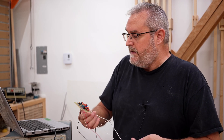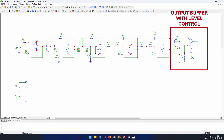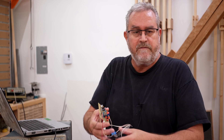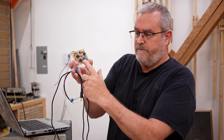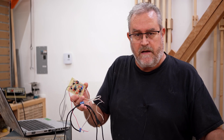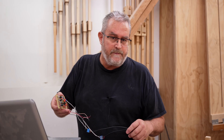The last stage is the output buffer, and it actually has a little bit of gain. It allows me to adjust the level of each crossover — so if the signal to the woofer is too high, I can reduce it with the pot on the board. Same with the midrange, the tweeter, and the mid-woofer — all of them have individual level controls adjusted by the trim pot on the board. I'll do this during setup with the amplifier lid off and the boards facing up.